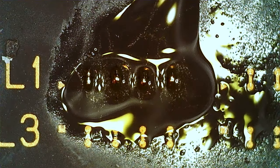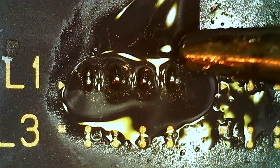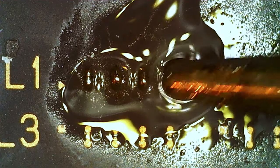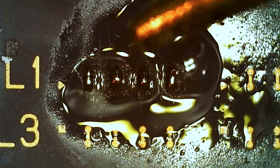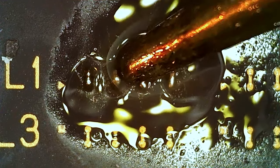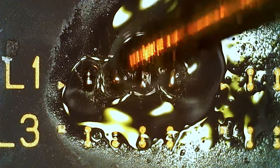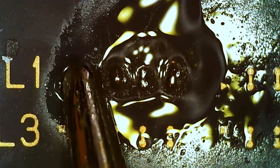I had to get the solder off the ceramics there, but I need to add flux anyway, because once you have connected the bridges and you have a proper amount of solder, not too much, not too little, adding back some flux and then soldering them again, they're gonna look nicer.